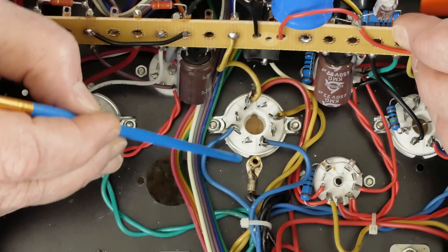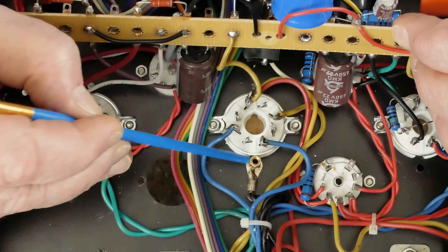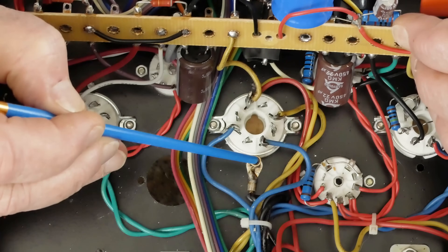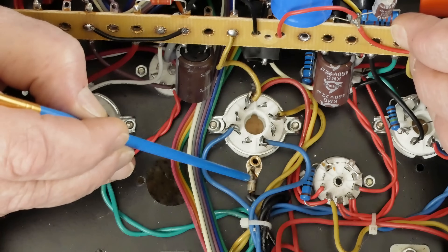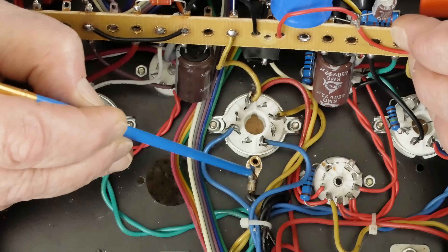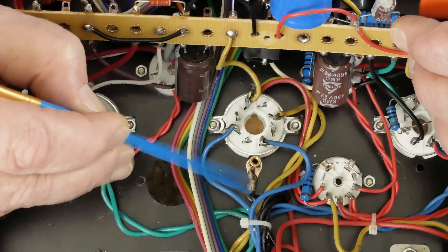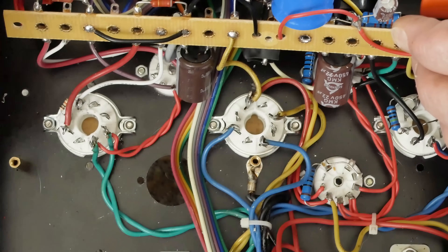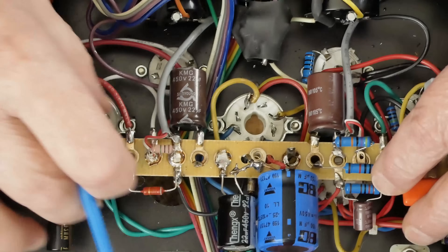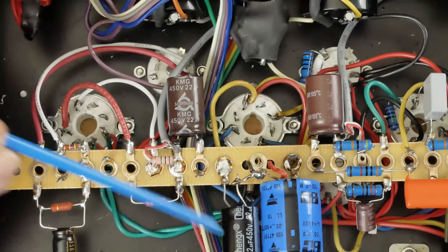One of the things I am going to do — I'm pretty sure that the paint is still on the chassis — so I'm going to remove this standoff and scrape the paint off, then re-bolt this down to make sure it's good and tight and we've got a good connection to the chassis with the star ground point.